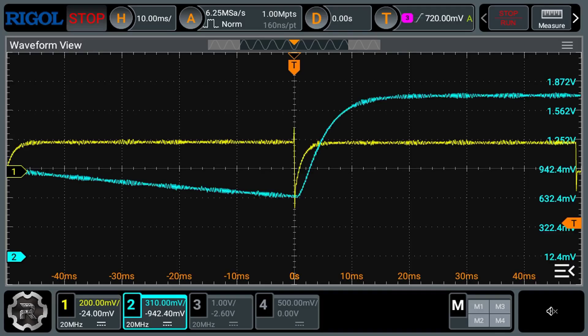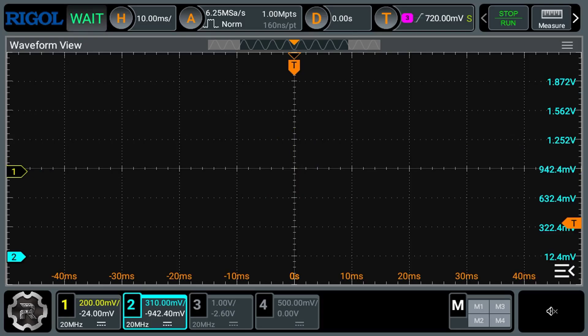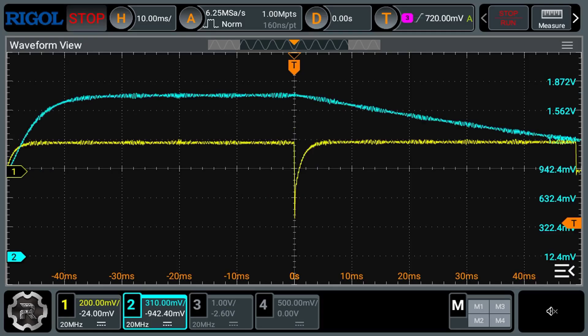The electromagnet is energized at one polarity for 50 milliseconds, then the polarity is reversed for the next 50 milliseconds. It takes about 3 milliseconds for the magnetic field to reverse. Here is the rise time waveform for the L3J board — it's around 10 milliseconds, which is faster than I remember. Here is the fall time waveform: even after 50 milliseconds it hasn't even reached the halfway value. So close enough to what I remember. They feel so smooth in a controller because the output is filtered way too much.